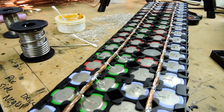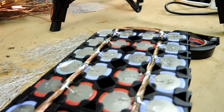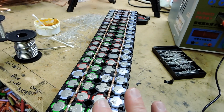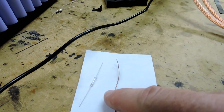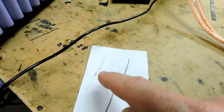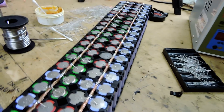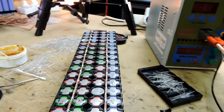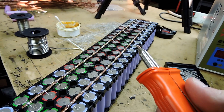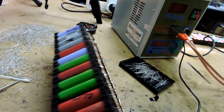Here we have the completed job for the negative side — the negative bus bar. Very neat and tidy actually, I like it. It took an hour or so to do the entire negative side, and I think that's just a little bit too long. The reason I didn't use the original wire is it just wouldn't spot weld — so I had to use the fuse wire as described earlier. It does work, it does spot weld, but it feels a lot slower than I thought it would be. Some of them I had to do two or three times to actually get them to weld.